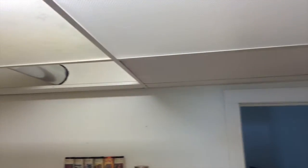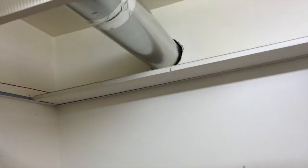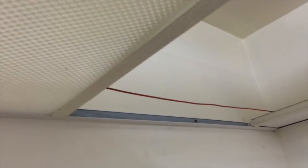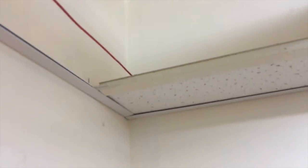The alternative for installation of the loop wire is in a drop ceiling when available. This makes it very easy to do while maintaining an invisible installation. Always remember to staple or zip tie the line down and be perpendicular to the metal as much as possible. Try not to be in the tracks, and keep our target height of eight feet. It can be extended a little bit, but not too much.